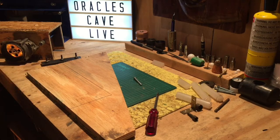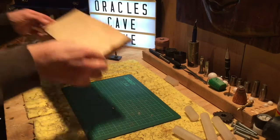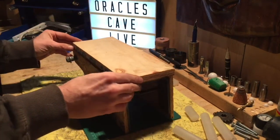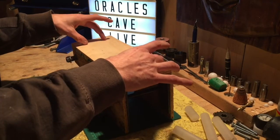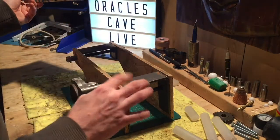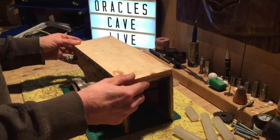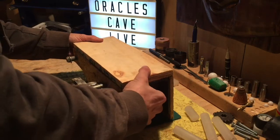We'll just use a jigsaw and chop it out. We have a chunk. Now all we've got to do is drill a couple of holes, then once they're cleaned out, we'll mark these holes onto the metal, then we'll disassemble and try and get the holes into the metal for putting some bolts through to help tighten it down onto the frame to make it rigid.